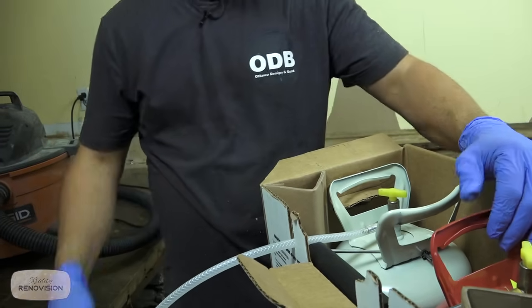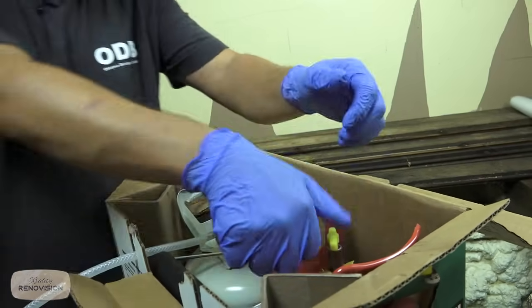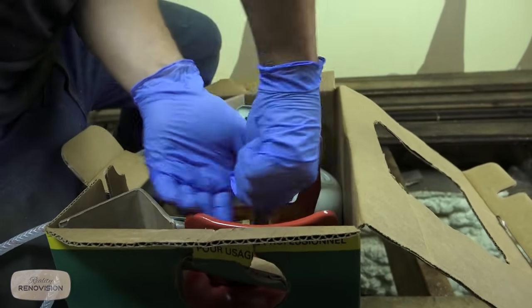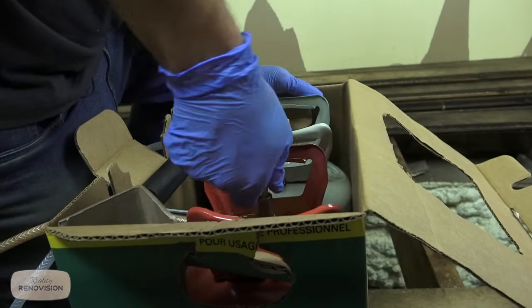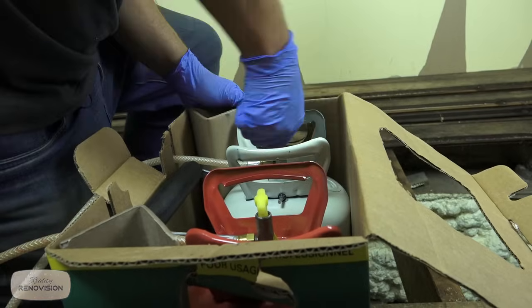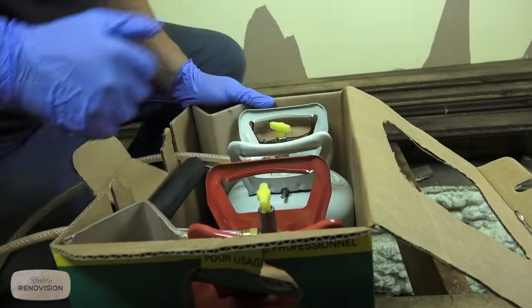Yeah, it is counterclockwise when you can get to it. Open cylinder valve, no more than three turns. If you are a he-man. Half, one, half, two, half, three.